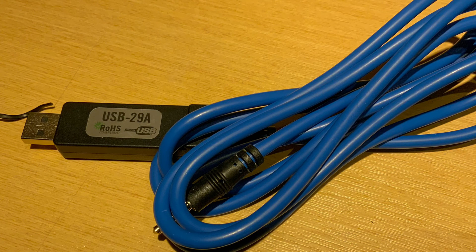I was able to pick up the programming cable for the Alinco, but I will give you some words of caution there. I have other programming cables — ones that do Wouxun and Baofeng radios, AnyTone radios, Baofengs. They're all pretty much the same: some type of USB with a computer chip in it, ending in a two-prong plug that goes into the side of the radio. What I found with the Alinco is none of those cables will work.